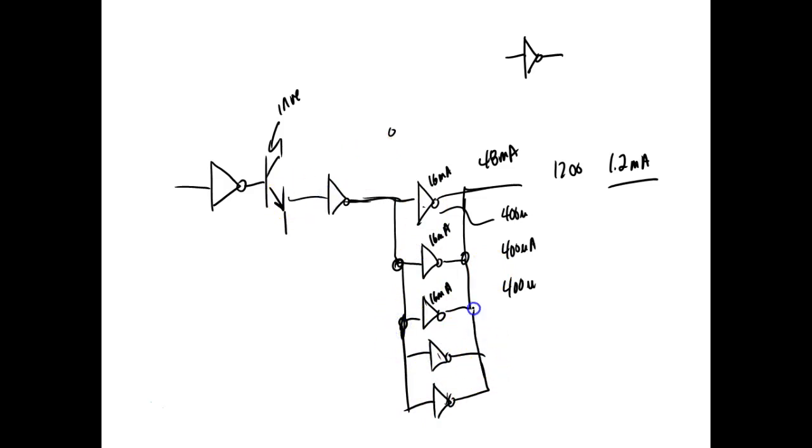And these are all connected together. So what kind of drive would that give us? If this is standard TTL, we assume around 16 milliamps. So what could this guy here drive? That's times five, right? Understand? So that'd be what, 80 milliamps? It could sink. And then 2 milliamps it can source. So that's exactly what they have it used for.